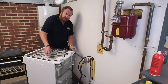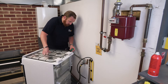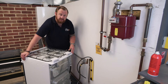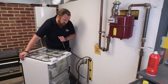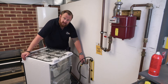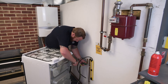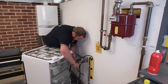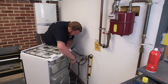It's important to make sure you're on the correct test point. The benefit with our cooker is it only has one. Our gas supply is off. Because there is no localised point of isolation, we have to turn the gas supply off at our gas meter, our ECV. If there is an appliance isolation valve — as on some other appliances — then we can turn the gas supply off there. We're going to remove the test nipple and connect our hose to it.